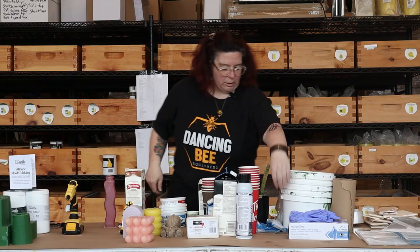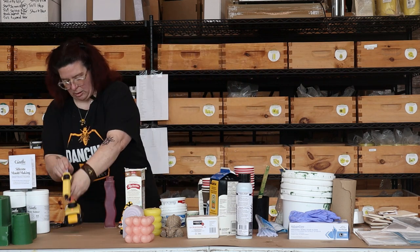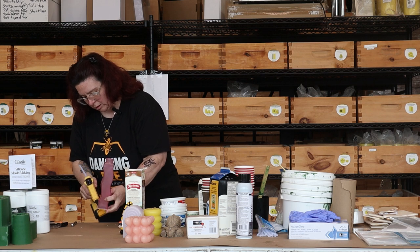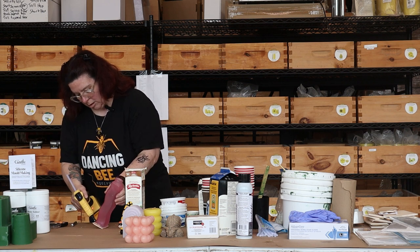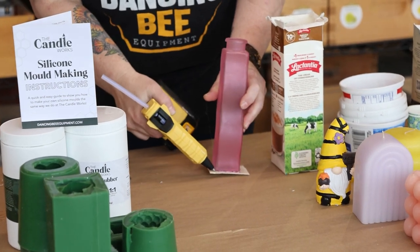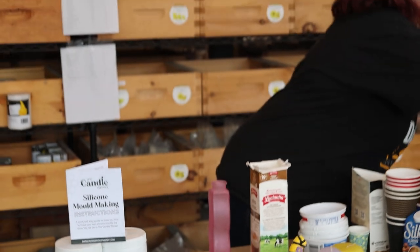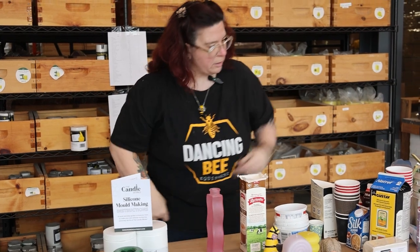Okay. If you want, you can make sure that none leaks under by sealing the hole here a little bit. We can seal the gap just slightly all the way around and then the silicone won't leak under there. Just like that. All the way around. Oops. Okay. You could use plasticine around that as well. The hot glue works really well. Okay. So when that's dry, oops, I put my glue back and I didn't need to do that yet.